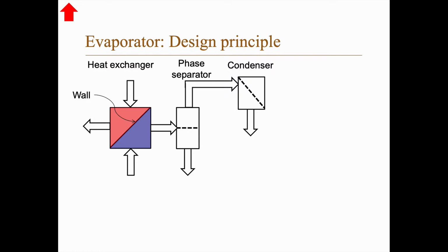Well, for one thing, you have a relation between the boiling point and the pressure. And then you have this setup, right? You have a feed coming in and it's being evaporated here. So part comes out as a liquid, part comes out as a vapor, and then on the other side you have steam and condensate. So can you make this work? Pause here and try to explain why it wouldn't work or why it would work.